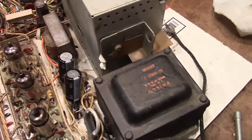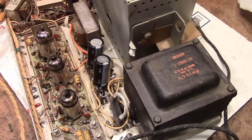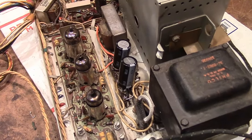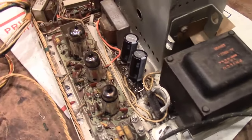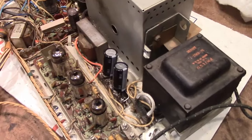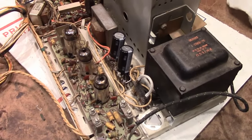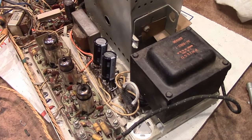So why not install a modern three-wire AC line cord and ground the chassis? I think you could. I know the topic has come up on the Antique Radio Forum, more relating to radio chassis. But I tend to go with the more conservative approach — if it ain't broke, don't fix it. These two-wire-type appliances have been around for many decades and they seem to work all right. You don't hear a whole lot about people getting shocked. So I tend to think I should just leave well enough alone, and I'll just replace that cap and resistor with a reliable modern component.